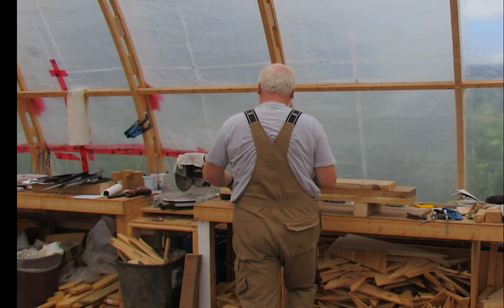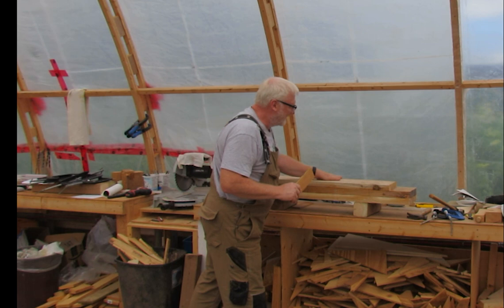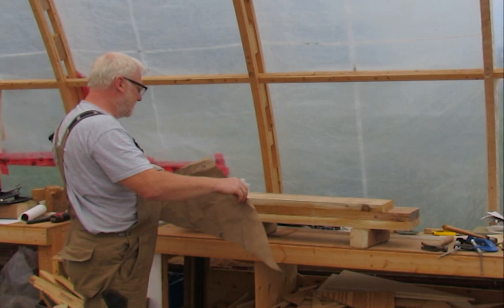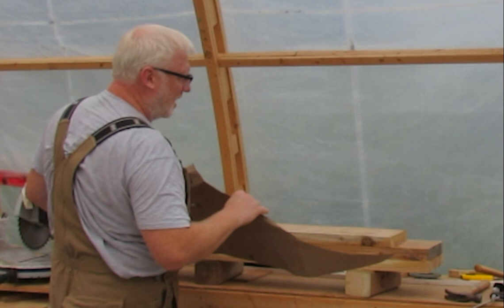So like they say, the wood gives way before the epoxy, so I'm gonna have to sand this a little bit down. So yeah, first section, that's bloody solid, and this is just a knee. Once I get the rest of the timbers milled up and epoxied up, then I'll just put my template on here. I'll tape it on and then make the outline and then cut it, and I'll have a stem knee.